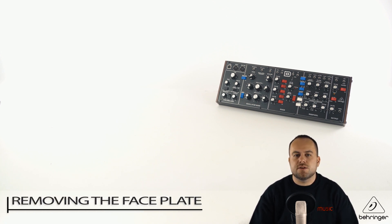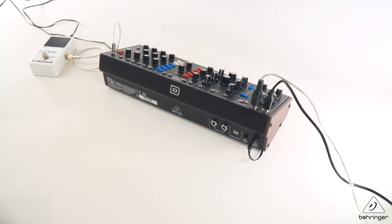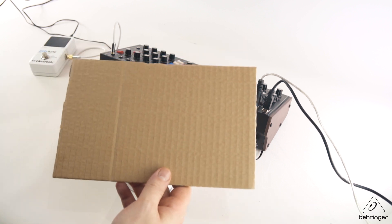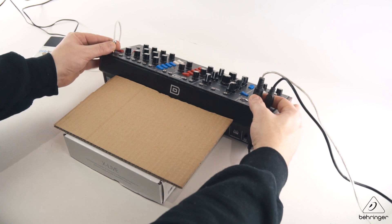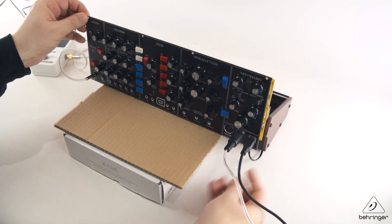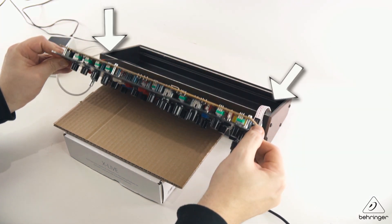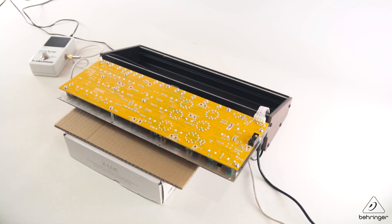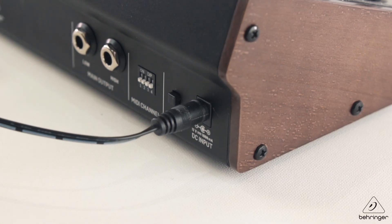Now that the synth has been on for the last 30 minutes, the components have had a chance to warm up. We now need to do a maneuver to get the top plate out and into a position where we can perform the calibration. Turn off the synth before doing this maneuver, and then once it's in place, turn the synth back on — try to do this fairly quickly so the components don't cool down. You'll need a box of some sort to provide elevation — I'm using a small cardboard box — and a piece of cardboard to put flat on top of that box, cut to size to leave room for the cable connections on each side. Carefully flip up the top plate of the synth, being careful not to snag the ribbon cable or the output cable. Then place it flat down on the cardboard box, and turn on the synth again. Once this is done, we're ready to start calibrating.